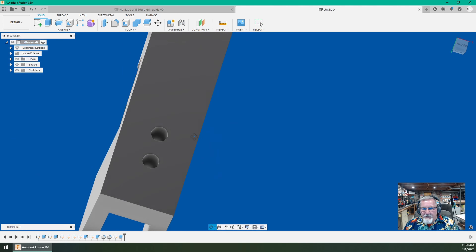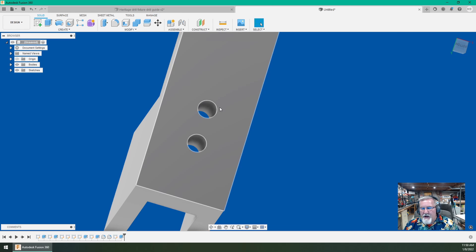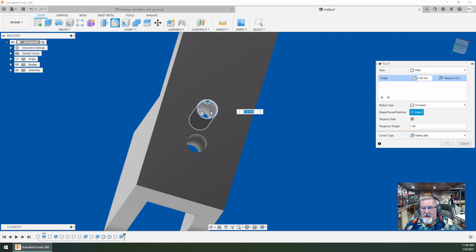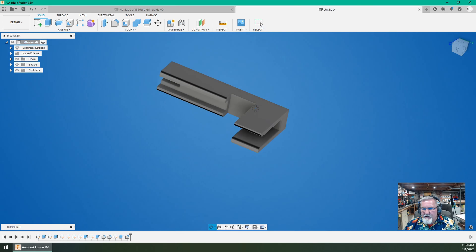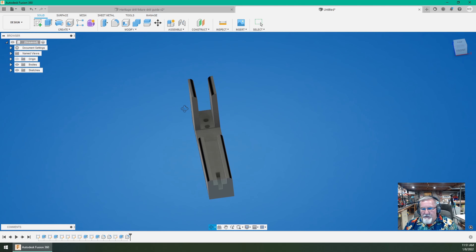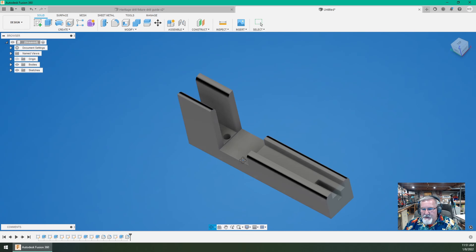The hole sizes I drew are sized to fit a drill jig bushing that I bought — I'll leave a link in the description below. I go up to add a soft edge on these two surfaces and put a two millimeter fillet, then hit okay. That's the entire drill fixture right there in all its glory — done and complete, ready to print. These dimensions are from the proven fixture I've already printed and actually used. That's how simple it is.